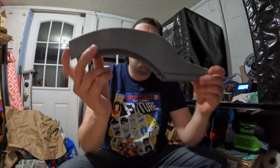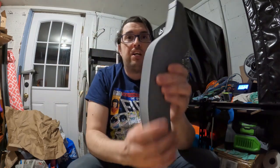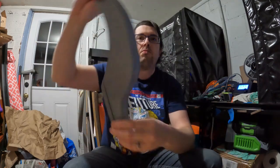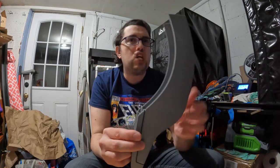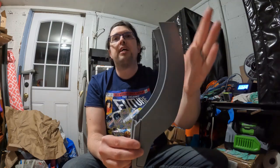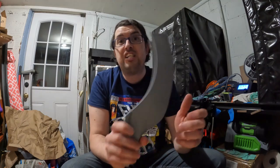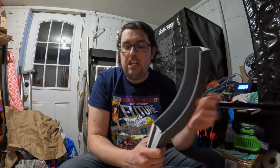The next part — I'm not quite sure what to call it, but it goes on the top towards the back of the helmet. I had it standing upright and did the overhang at about 20 degrees, so I had a lot of support to hold the whole thing up so it didn't fall during printing. I had the majority of this print going at about 170 millimeters per second, then slowed it down as it got higher to make sure it didn't fall.